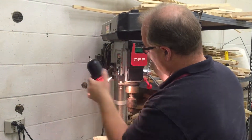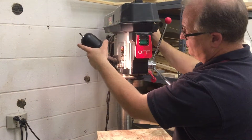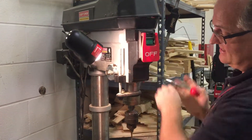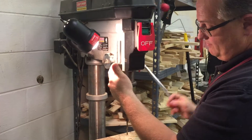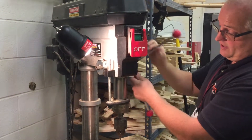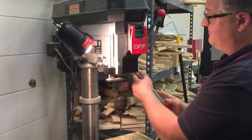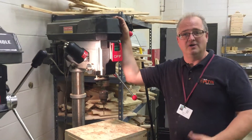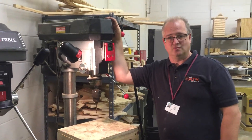And of course our light over here as you come through. The other thing you need to be aware of is our stop and our miter here, so that we can set that stop and be able to move up and down a certain amount on the quill. Be aware of all of these different parts on this machine so that you know how to operate it safely when you're using it here at Danville High School's Wood Lab.